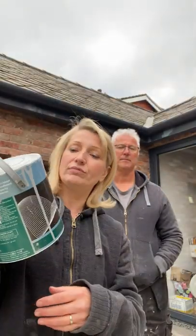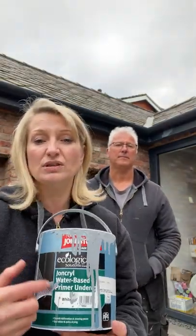This is a Johnson's paint. We're not paint brand affiliated - I use Dulux as well and other brands - but the Johnson's one in the UK is pretty good. Another tip: if you're going to do dark colours, because a lot of people are doing dark greys outside now, have your undercoat dyed dark grey at a trade place. Because it makes it easier when you put a dark grey top coat on - you wouldn't want to use a white undercoat and then put grey on top of it.